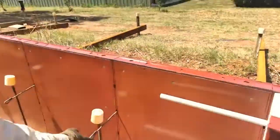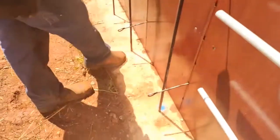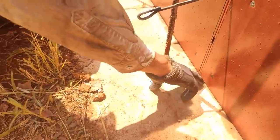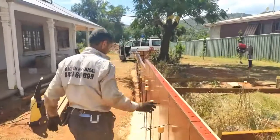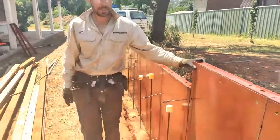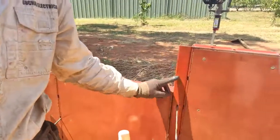There'll be a saw cut here and the crack will go there. Basically we've got our ties in here and our marks that have all been marked with a string line — can you see those marks? They've been measured back 150. See that other mark right there? That's making the wall gap perfect. Then we're going to level these up — this one's already been done. You can see we've already put props on here, so this wall has been leveled. Coming along here, Hamish put a note to put a filler in there.